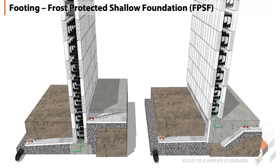You can also do what's called a frost protected shallow foundation — a situation whereby you can't get a full depth required for frost protection in your area. We deal with this by having horizontal rigid insulation on the outside of the wall at whatever depth is available. On the left side it's a regular ICF wall down to a standard footing with insulation tapered outward from the outside of the wall for frost protection. On the right is what we call a thickened edge slab, where you have insulation under your slab but on the outside you must add that horizontal rigid insulation to achieve frost protection.